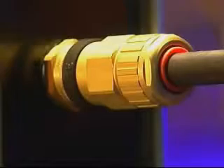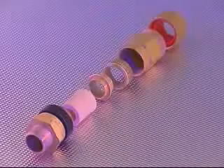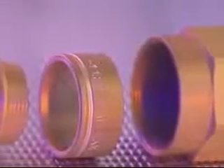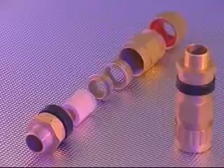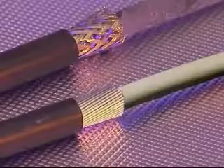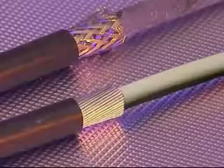General description of glands. The ICG-653 Universal cable gland comprises six major components: the back nut, middle nut, reversible armour clamping ring or RAC, armour spigot, compound pot, and entry component complete with deluge seal. This cable gland accommodates all types of elastomer and plastic insulated cable, incorporating all types of armour, the most common being single wire armour and wire braid. The cable gland is specifically designed for use with cables which are not effectively filled.